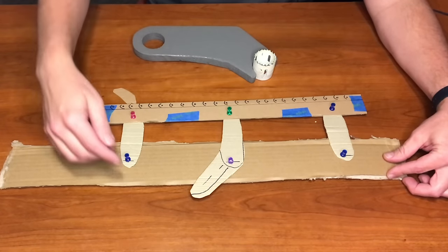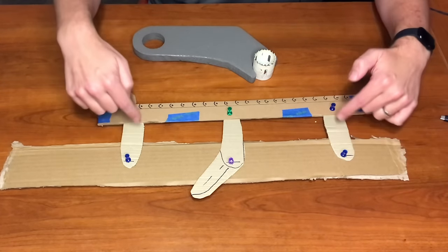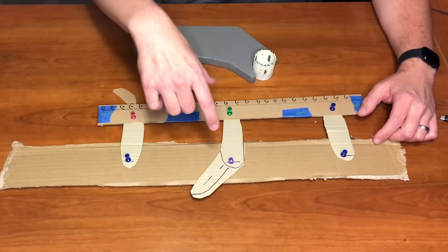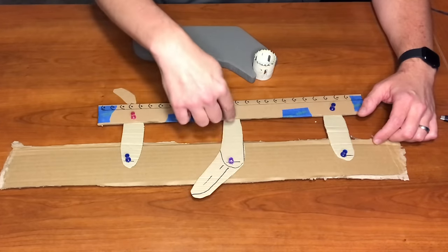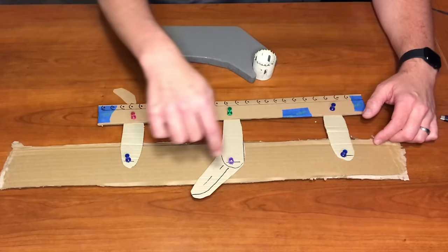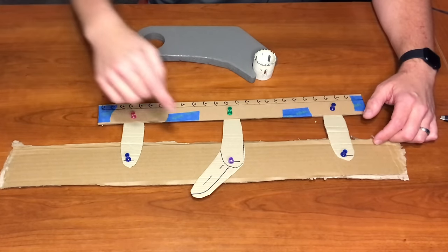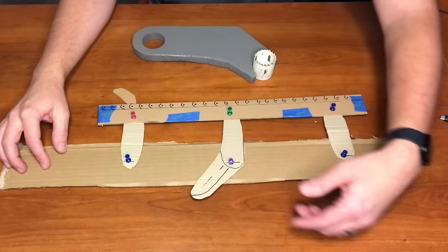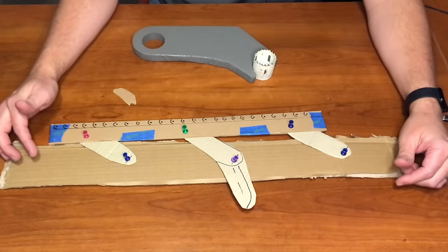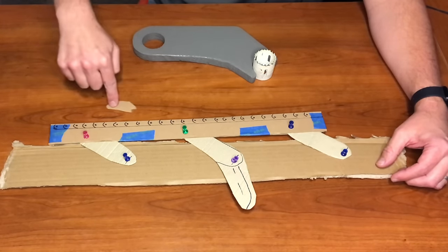Once we're up towards the top right there, all we do is we use a pneumatic ram underneath the trough. And you have these support brackets right here that support the trough going all the way up. And then there is, let's see if I remember this right, three pneumatic rams, which is a support lever with basically another cantilever lever off the side of it. There's a pneumatic ram, three of them going up the lift as well. And once the train makes its way up there and hits that first prox, it tells all three rams to energize. See if this works. And it simply drops the trough forward like that. So once it drops the trough forward, then the chain dog here unlatches and it's free to roll back.